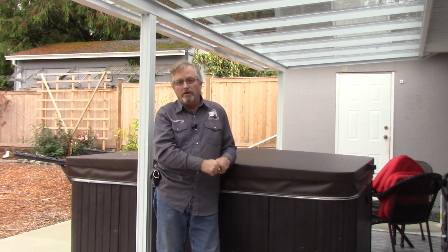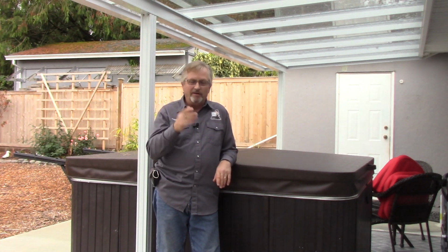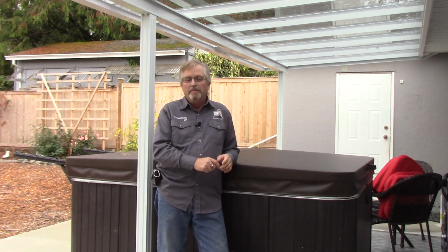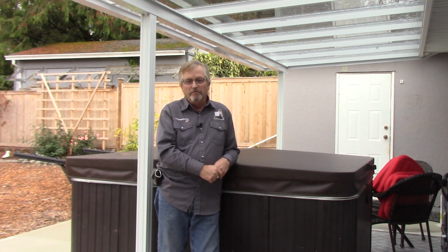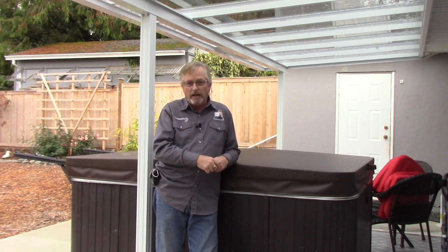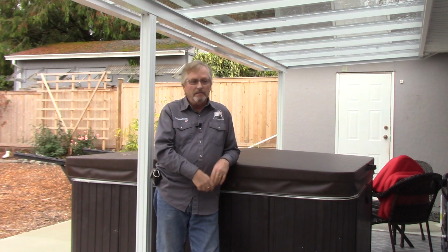In the one we're going to do in the project video here, what I had is a big empty 40 circuit sub panel that only had 3 circuits in it in the basement, so it was a crawl space, easy or semi-easy access to get to the outside to where we needed to put the service disconnect. So I wanted to utilize that panel and saved a little money, because a spa pack is anywhere from $250 to $300, and that has the breaker included with the panel. In this case, I only paid about $200 for the breaker to go on the existing panel, and then we needed a 60 amp service disconnect outside within line of sight of the tub, but out of reach again.